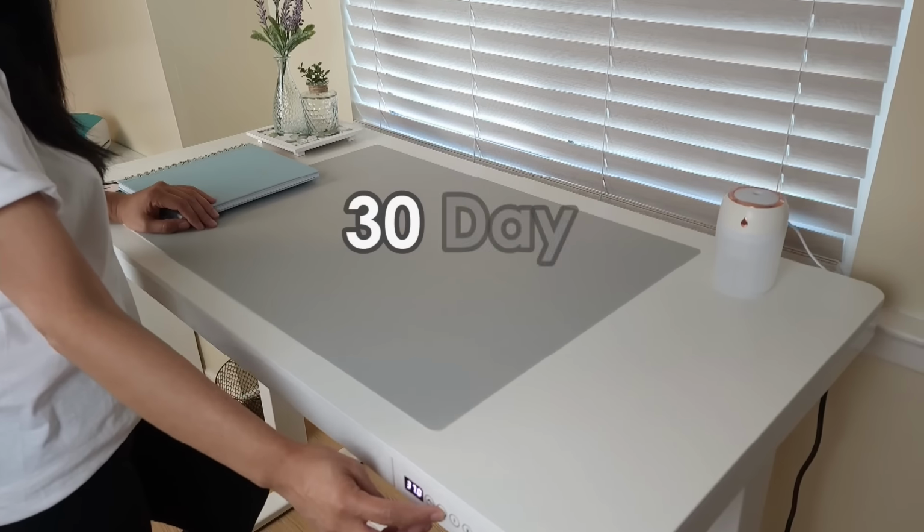I'm going to stain the 1 by 2 inch boards in the shade Early American by Varathane. So I apply that all over with a cloth, and then I wipe it off immediately with a clean cloth. For a deeper tone, you can leave it on longer or apply a second coat, but always make sure to wipe out the excess. Here I make sure to leave the areas that I know I will be adding glue unstained. I also apply the stain on the ends or the end grain.